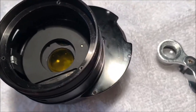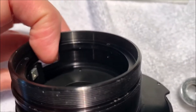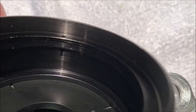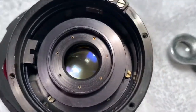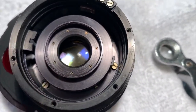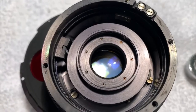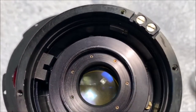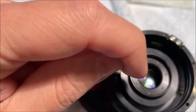Since I still can't figure out how to get things taken apart on this side - you notice in here there's this little black portion that sets the limits of the focus travel - that's a separate piece, that's what those screws engaged into. I can't figure that out yet, so I'm going to retreat to the other side and remove those three screws to take out the lens and iris assembly. I already removed part of it just because I started unscrewing things, so I'll put that back.